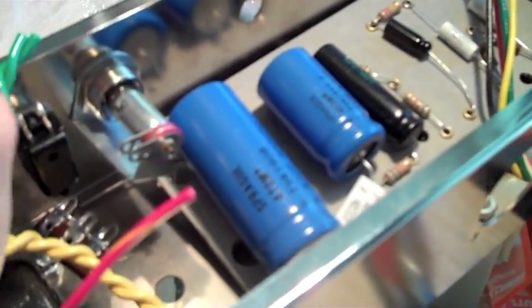All I've got left to do now is cut the black wires, which is where the AC comes into the power transformer. One goes to this side of the power switch — you can see that's the power switch. And then the other black wire goes to the fuse holder, down here at the bottom. So I'll do that. I'm going to take everything out, and the next thing you'll see me do is drill a hole right here for the impedance switch.